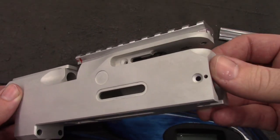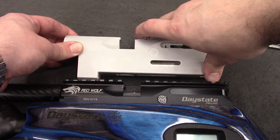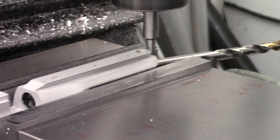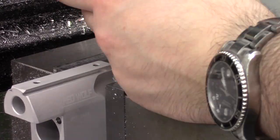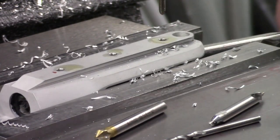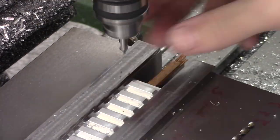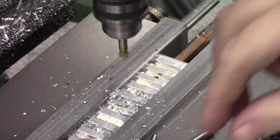Once the dovetail is cut in the bottom of the pick rail we've measured up the block and just cut the pick rail into two pieces. We're still a little oversized on the length so we've got to trim that down, but for now I'm just comparing it to my other red wolf with a pick rail on top because I want the pick rail roughly in the same place. Once we know where it wants to be we can cut it to length and start working on the decorative features like the rounded corners. I'm rounding the corners off with a corner radius end mill just to get a rounded edge that matches the block. Once the pick rail is ready to be mounted we need to drill and tap the block for the securing screws — I'm going to be doing that with three countersunk M3 screws, with the spacing so that the screws are between the pick rail slots. We're drilling and tapping the block first just using a form tap, and these are through holes. Once the holes in the block are done we can do the corresponding holes in the pick rail. The rear most hole is the screw that holds the cocking lever on, and then the other three are for the countersunk screws. Countersunk screws are done so that they're just under flush, meaning when we go to put our scope mounts on we don't have to worry about the screws interfering with any of our scope mounts.